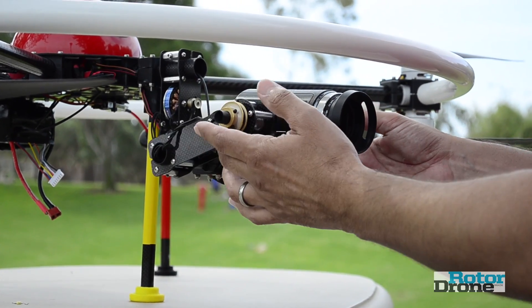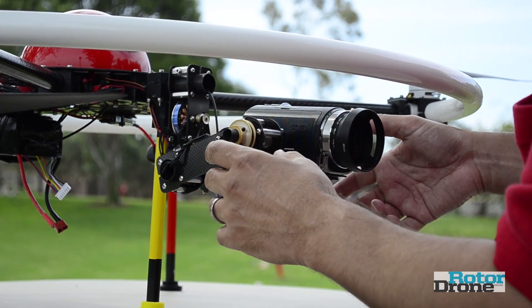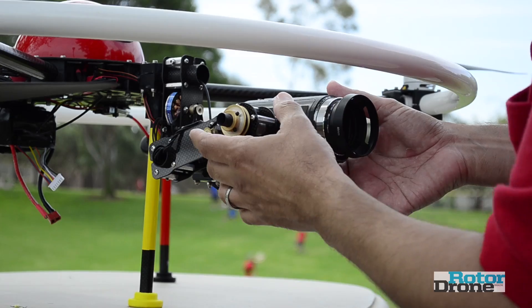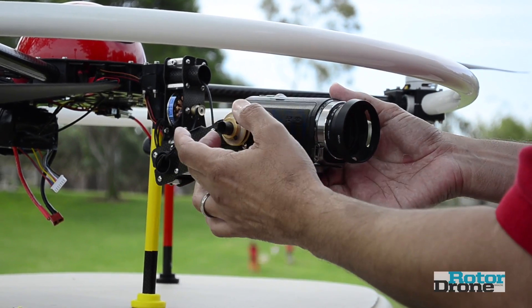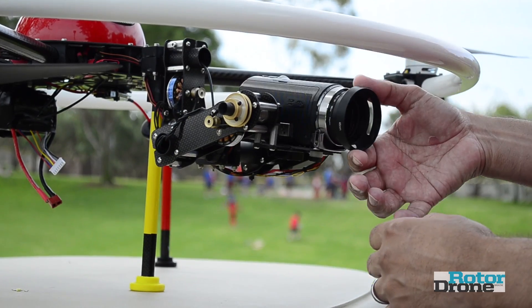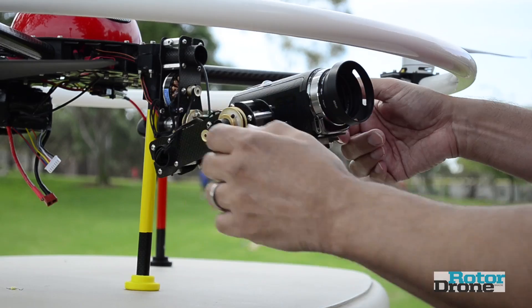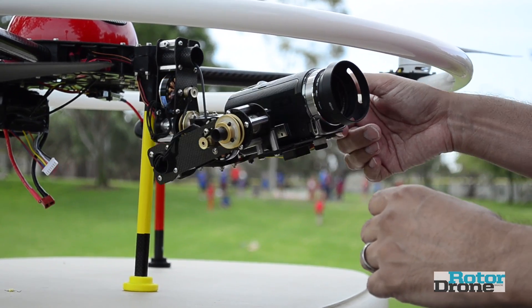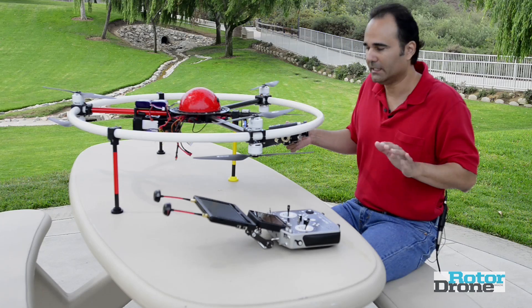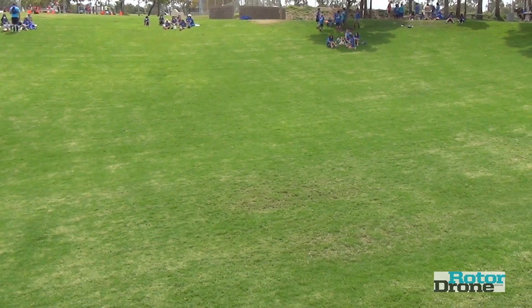In this case, we have a belt drive camera gimbal, which increases the torque. If I undo the belt, you'll find that this camera balances perfectly in this axis. And if I undo this belt, it would balance beautifully in the roll axis. This is really critical for the camera to operate smoothly and properly — you'll have much better imagery and won't have any jitter or problems with your camera.